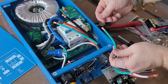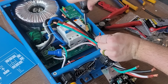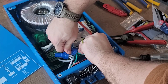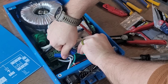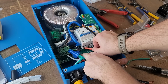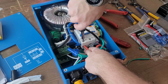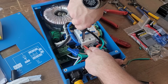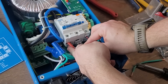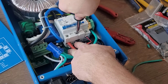I'm doing the same for the ground — making a pigtail for the right side. The yellow and green box on the right is where the ground goes for the 240 volt output. The three green cables inside the box now get tied together. The red goes on the left side — this is leg one output for the 240 volt. Make sure it is nice and tight. Then the black goes into the right open port for the second leg of the split phase power. Again, make sure it's nice and tight.